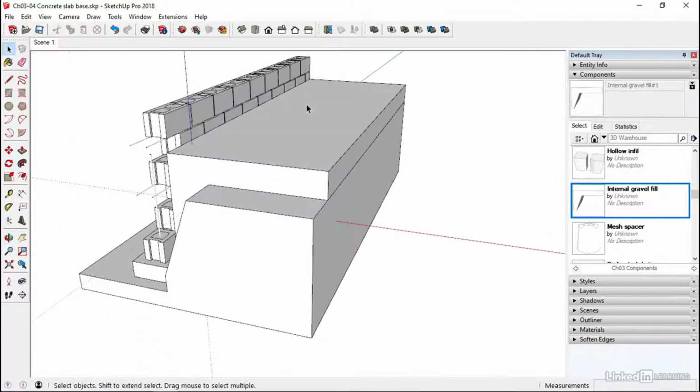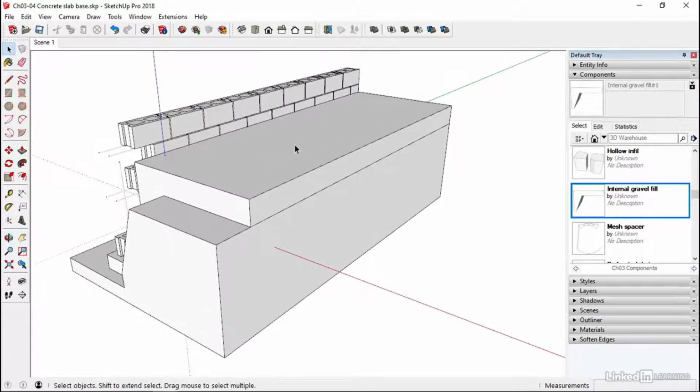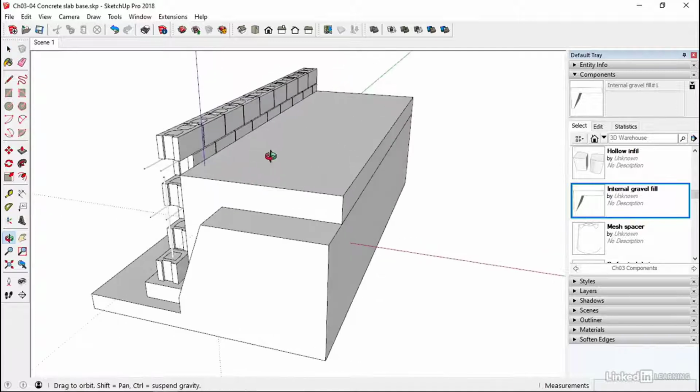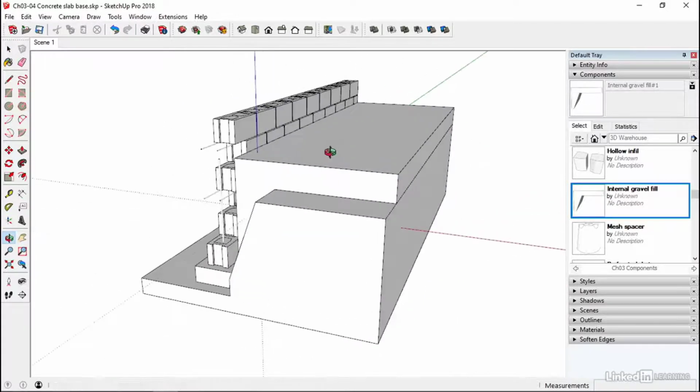The next thing is to blind off the top of this with some sand. Now the blinding is going to do a couple of things. It's going to protect any membranes you put on top from being punctured, especially if you pour a concrete slab on top of it. We will be putting our closed cell PIR insulation on top of the sand, and then we'll be putting our membrane on top of that. Other people might want to put the membrane down first and the insulation on top of that, but I'm making sure I've got adequate protection for the membrane. So a bit of sand and a bit of insulation, nothing's going to get through that.